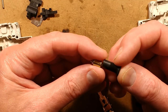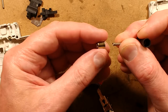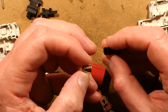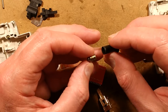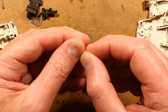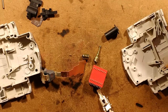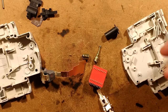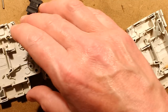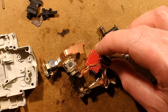When I took this apart it kind of fell apart. It's got this little plunger pin with a spring. I think these are in the correct order because it really did fall into lots of bits — and there was dust. It had a little bit of dust, and I think that's what caused it: the pin went up, then the dust caused it to stay stuck, so the only way it would go back down was if you pushed it. I don't know if the dust crept in from plastering in the vicinity. It makes you realise that if a bug somehow got into the circuit breaker it could gum up the little plunger and stop that function working. Very interesting — I've never seen that before.